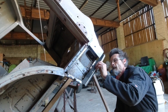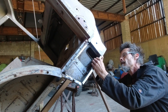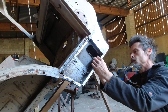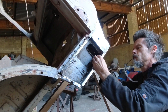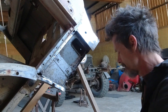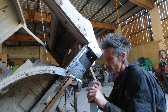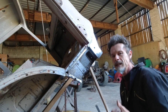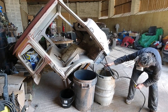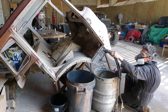Tim continued making the repair to the panel that was originally taken apart because of rust holes. He briefly considered just patching it from the outside — putting another layer of steel over the top — but didn't want to bodge it, especially as this panel is where the cab steps bolt on. In the end there is always a balance between bodging something and doing a complete restoration job. Just a little more off, tidy that bit up, and the job's good. In so much as time and budget allow, they aim towards the latter. The next step was to get the vapour blaster out, clean off all rust and residue from inside the panel, making sure all surfaces were nice and clean before starting on the reassembly and welding.